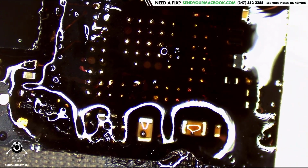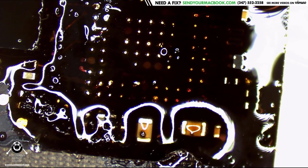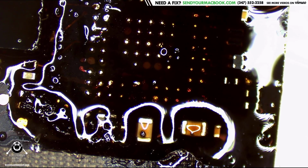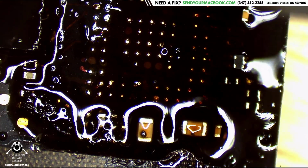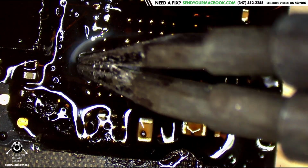Okay, now we're gonna put some little jumper wire cables. Little mini, not cables. If it's thick enough to be a cable, it's not gonna be a good jumper. I forget if this is 44 or 46 gauge jumper wire here. We're gonna take little bits and pieces of jumper wire and put it on these points.